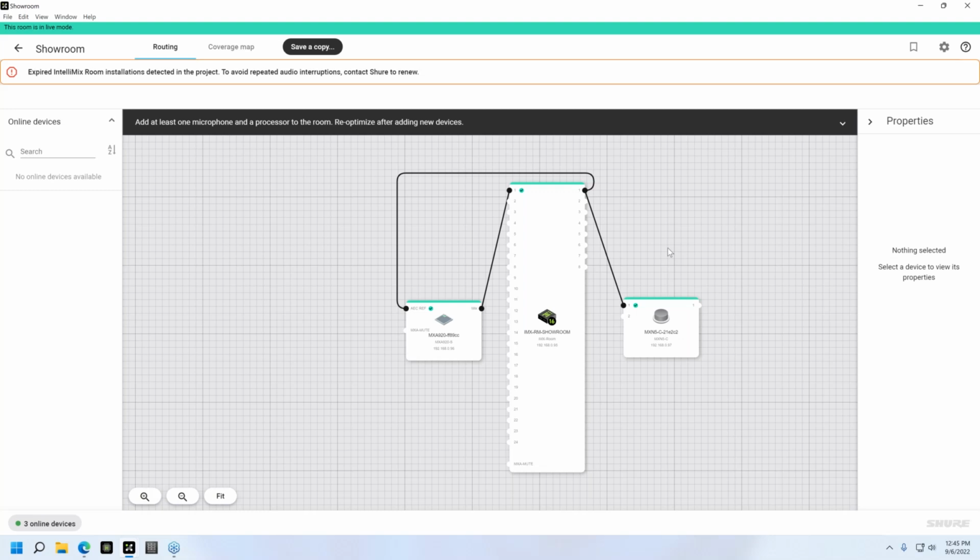Right. We could use the lobe output of those two 920s, which are 8 lobes from each one, straight into an IMX Room software. And that software will allow us to do the auto mixing of all 16 lobes as if it were one giant 920. I'd like to take a look a little bit more at that auto mixing because the MXA920 also does the auto mixing. It does. So let's take a look at that within the MXA920.